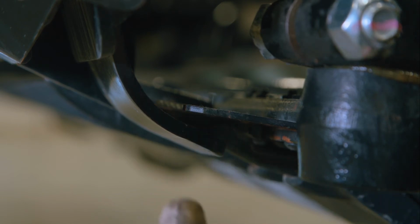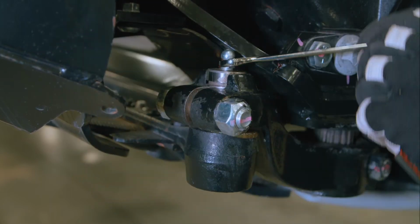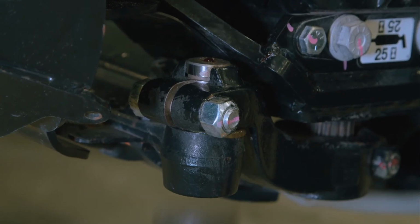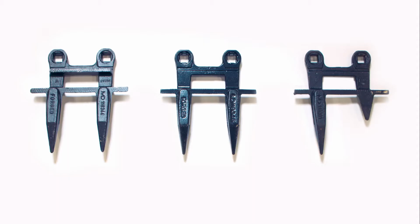There may be a scenario where the knife worked fine yesterday, but now after servicing the knife is stalling and going over relief. This can happen quickly when using electric grease guns. If the knife is over-greased, remove the grease zerk and push up on the knife head to force out the excess grease. Then reinstall the zerk.